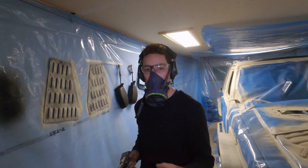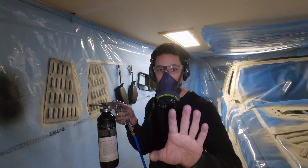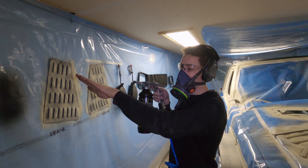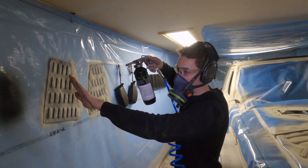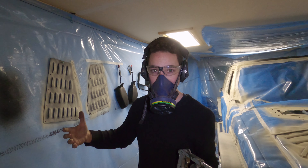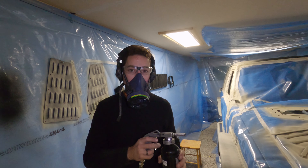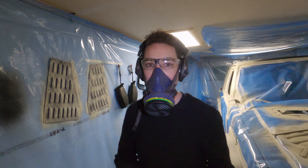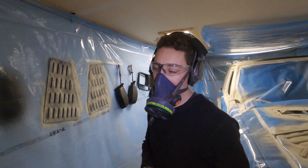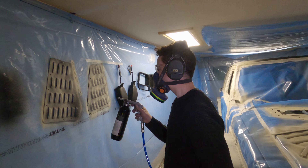That's what we're looking at — around 60 psi. And an important thing to note: always spray directly at the face of the panel. If a panel's like that, don't spray it at an angle — always spray it straight on. Otherwise what happens is those blobs that form the texture become elongated. You always want to be facing straight on a panel if you can. It's not always a big deal, but at extreme angles it really shows.